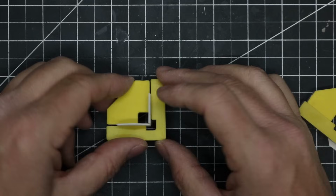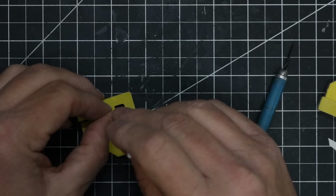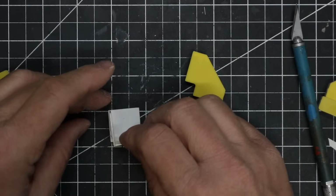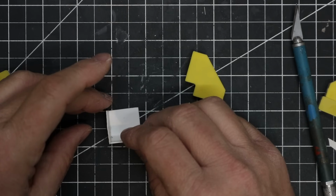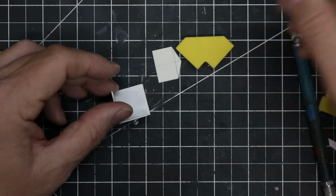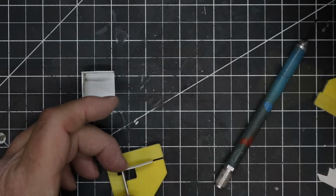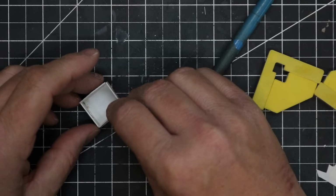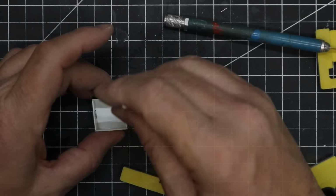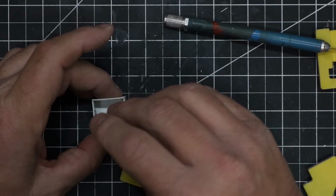Then I began assembling the walls, using corner clamps to keep the first corner square and cementing the inside of the corner joints. When I had one corner cemented together, I fixed it to the foundation, then repeated the process with the other corner and the other pair of walls. I then cemented that assembly to the foundation, checking that everything was square, and I cemented the other corners into place. Again, take extra care and time here to keep everything square, straight, and aligned.